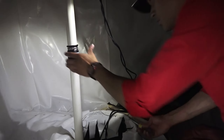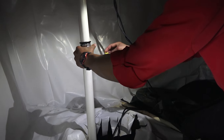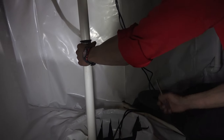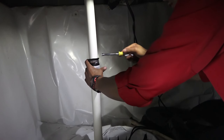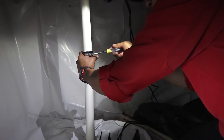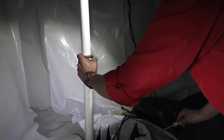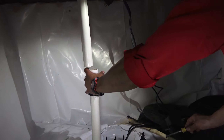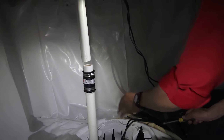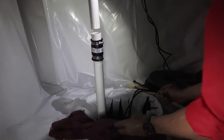We'll have to remove this coupling to be able to get it back together. Once again, you want to start with the bottom and do it nice and slow. Allow some of the water to drain, and loosen the top one as well. If you don't see it, you'll sure be able to feel it as it's making its way down. It's essentially what'll happen when you take it off too fast. Luckily, it didn't spray everywhere, so we're good. Always expect water to come back down as you remove your coupling.